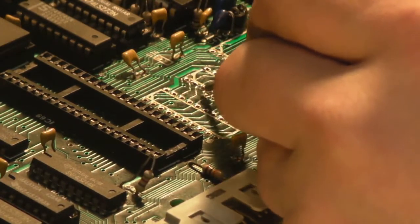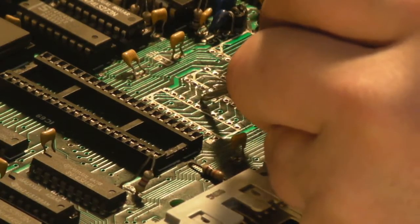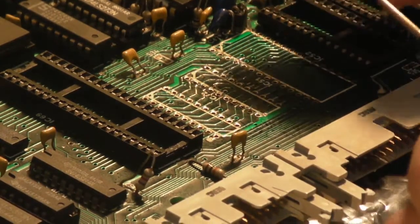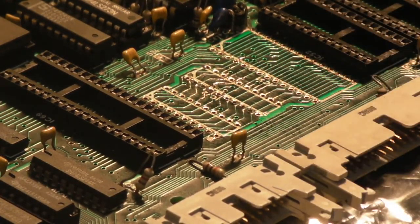We're all right there. That's it there. No, you see, that's one of the ones that I've broke when I slipped with the knife before and damaged it there. So, even if we solder that in there, we've still got another break there. So that's really one that we should look at repairing with a wire underneath. Now, where is that hookup wire that I dug out earlier?